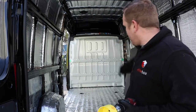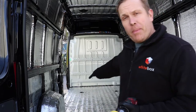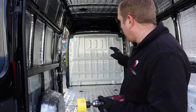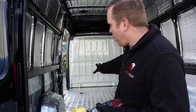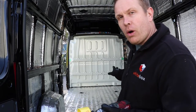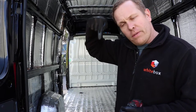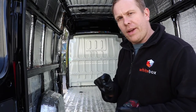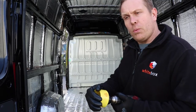Now we've installed the floor vents in the lower part of the floor, cutting the minimum 100.5mm — I had a 102mm hole, which was pretty close. You can go a little bit bigger than 100.5mm, so that's perfectly fine. Next thing is to cut an 83mm hole in the wooden floor. We drilled all the way through the floor earlier so we know they're going to line up because the pilot hole lines up. So the next thing is cut the 83mm hole in the wooden floor, lay the floor down, and then put the grilles over the top.